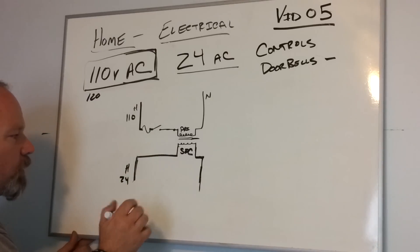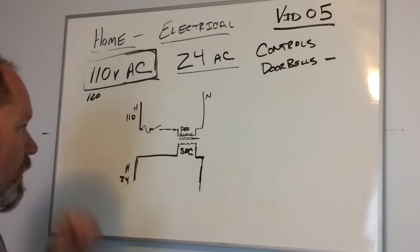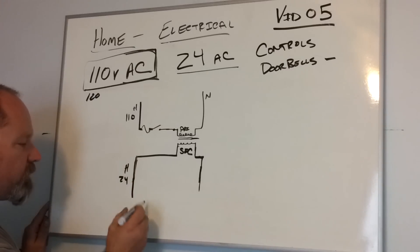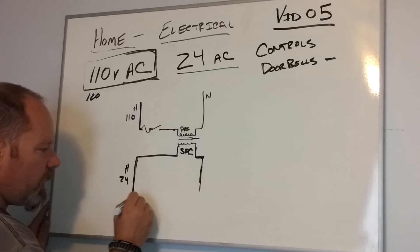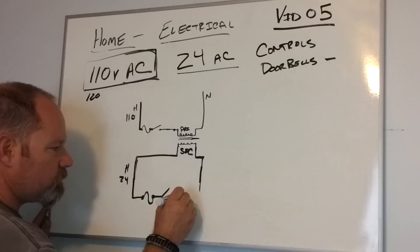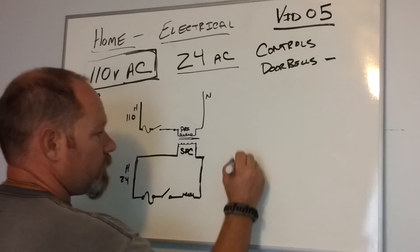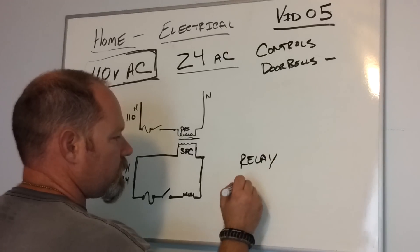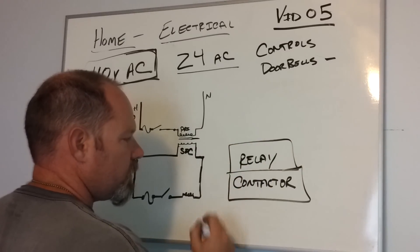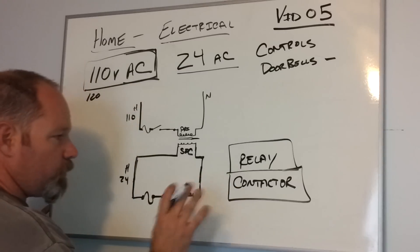Now we're coming down here, and what we're going to do is be inside of a heating unit — we're going to call it inside of a furnace. The thermostat on your wall is typically run off of a 24 volt circuit. And again, just like everything, you've got to have your fuse, got to have your switch, and then you have to have your load. This could be a relay or a contactor. Relays and contactors are similar because they are a switch that would switch higher voltage — we'll get into that shortly.